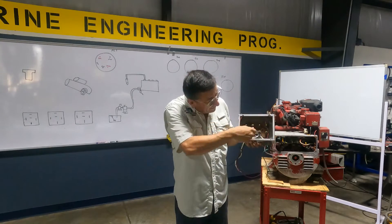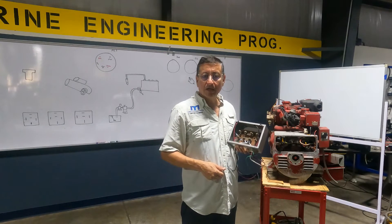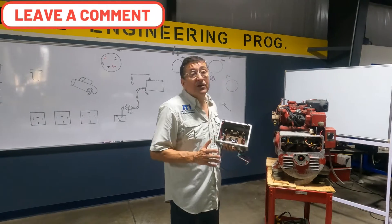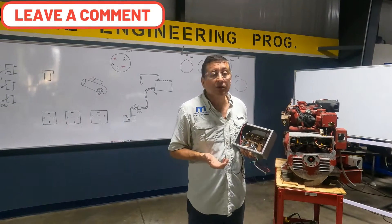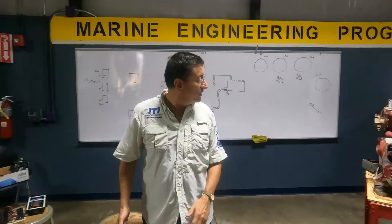I can remove those terminals and verify with the megohmmeter how is the condition of each winding — and you know, the generator is good or the generator is not good. I want to check this generator with the megohmmeter.